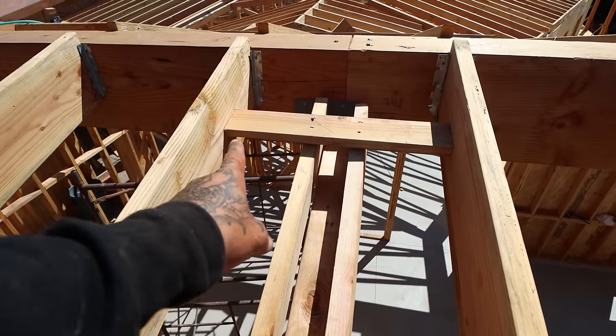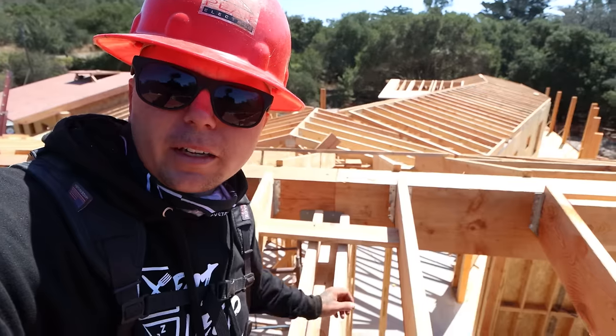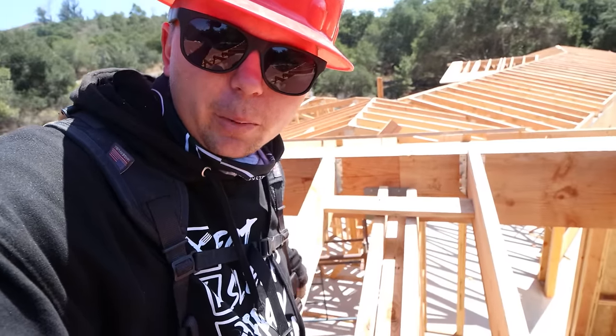We have our wall right here, 3.5 inches up, 3.5 inches up, 2x4 on both sides. Now, since we went 3.5 inches up to determine where this block was gonna go, that means that our drywall backing here and here are perfectly in plane with the rafters that we have up for this roof.